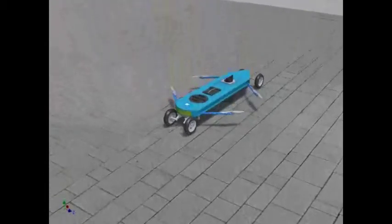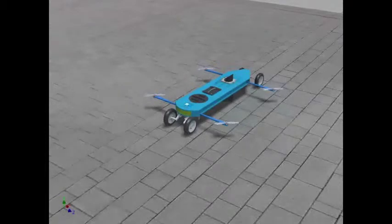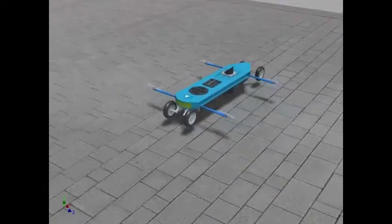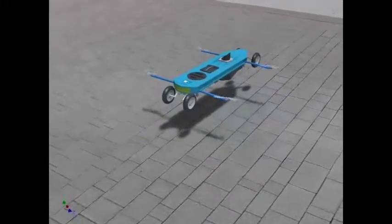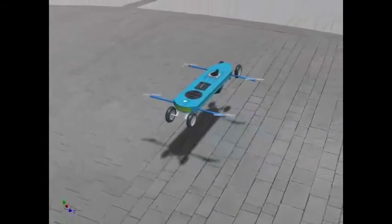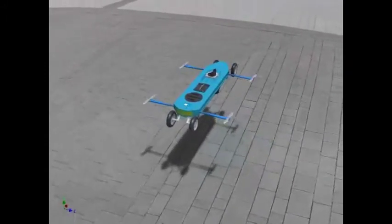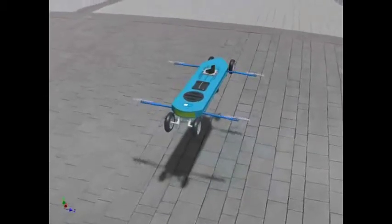I also designed the retractable arms that are going to hold the wings. These arms can go into the cavity at the side of the board and retract in and out from there. At the tip of the arms, or palms if you like, there are hollows to place the motors that will be rotating the wings. We needed to rotate the arms 90 degrees out and back into the board, and to achieve this, we connected them to servo motors that were designed by my teammate Jonah Bergen, and he is going to tell you more about them next.